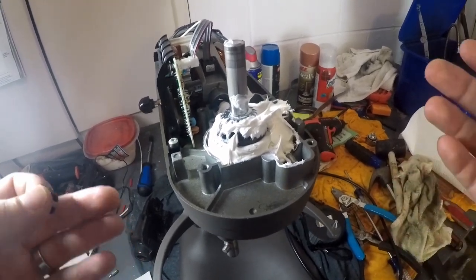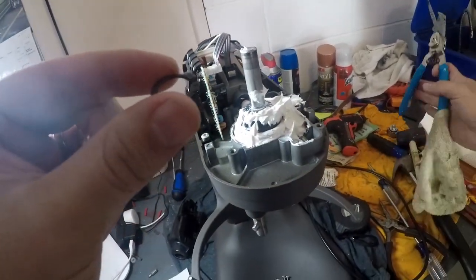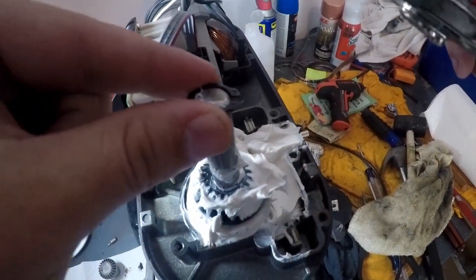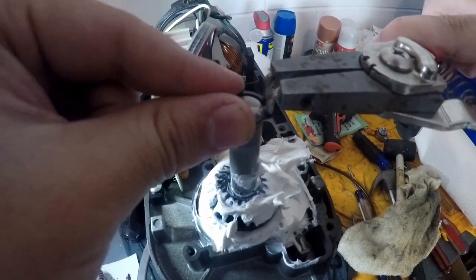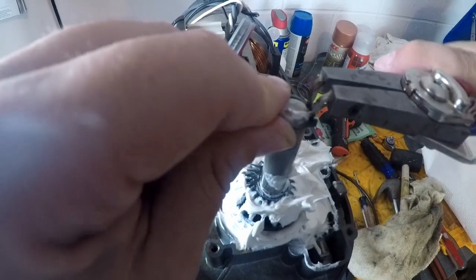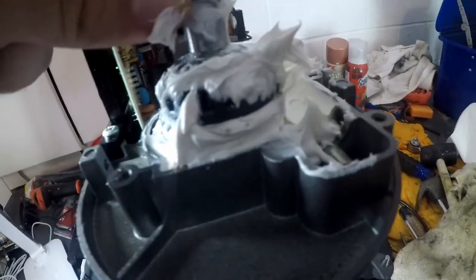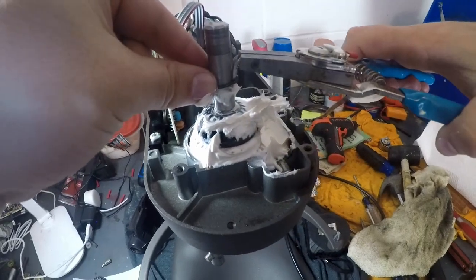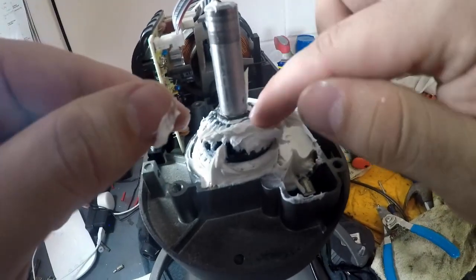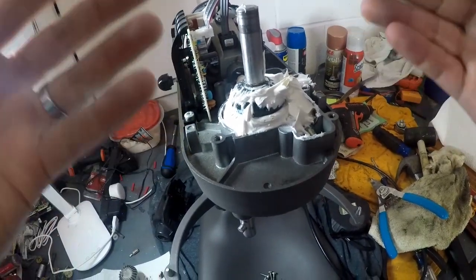Now that we have the worm follower gear and the bevel gear back in place, we want to go ahead and put this split ring back on. We're going to take our split ring pliers — I just set it on top like that, then get your little nubbins in the hole. Apply pressure here, downward pressure to hold it in place, and as I open this up it's going to slide onto there. Now we've got it around — put downward pressure and keep spreading it. You can see down here that little channel I was telling you about — you will feel it kind of click into place when you have it. You heard it click, and get it all the way down. It's back in that channel — you can't just pull it up now, it's locked into place.